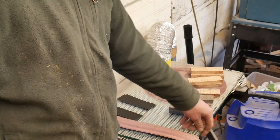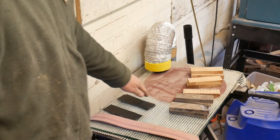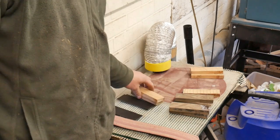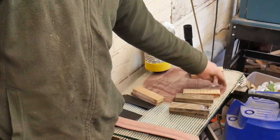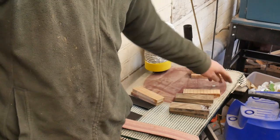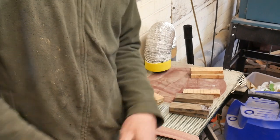This is a piece of plate glass about half inch thick and I've got an abrasive disc — this is about a P60. It's got a sticky backing so it sticks to the glass, makes for a very flat surface.